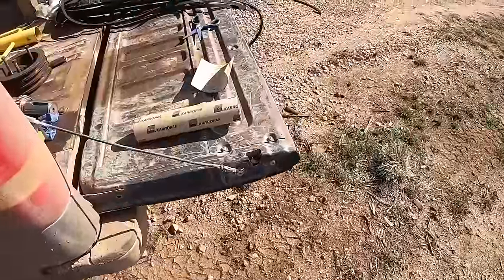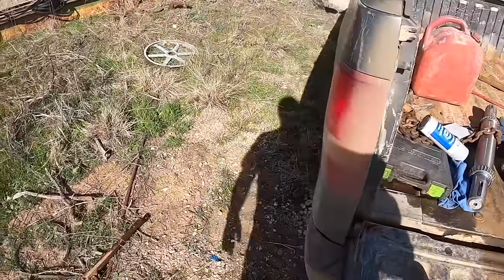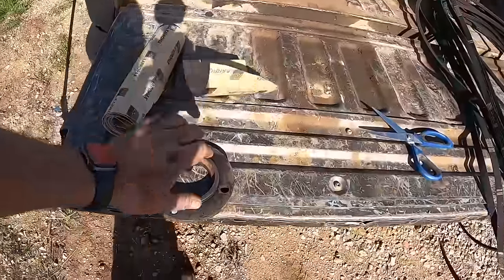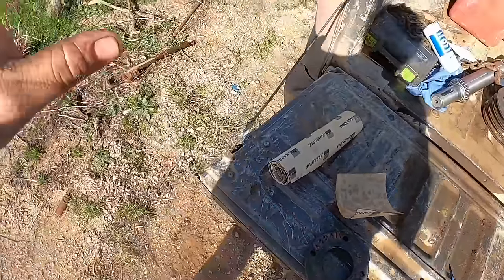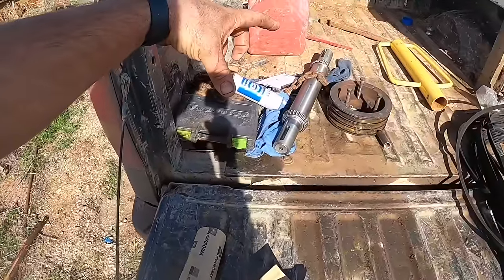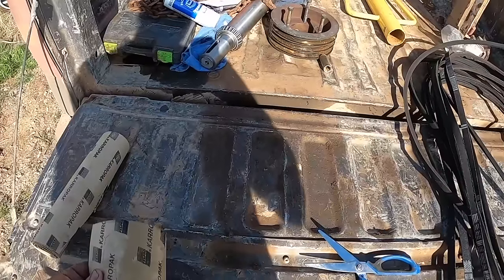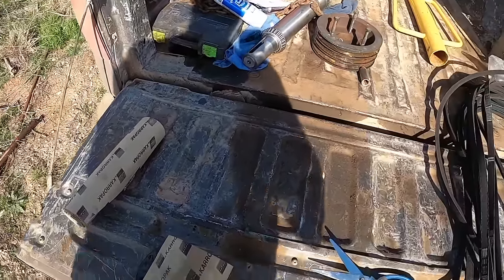Okay, I got everything hauled out here, I think. We are ready to put this thing back together. The first thing I'm going to do is make a gasket out of thick gasket material for the far side. I'm not going to put the seals in these end plates yet. We're going to assemble it knowing that it's going to have to come back apart. I'm not sure exactly how close the distance between this bearing and that bearing is in comparison to the other one. And so I'm going to start with an extra thick shim, extra thick gasket. And then we will adjust from there.